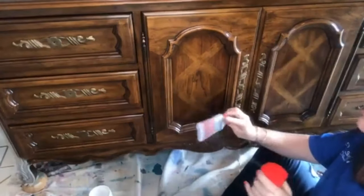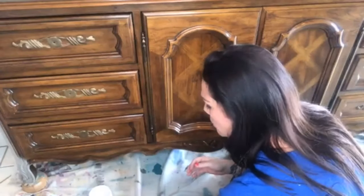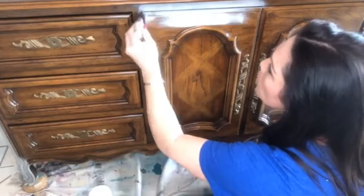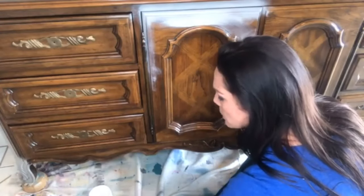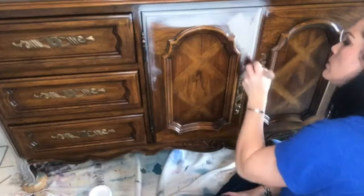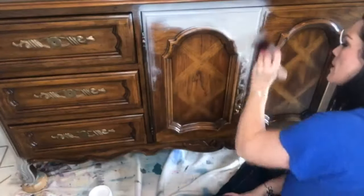Before I start painting, I always lightly mist my brush — not soaking wet, just a little bit damp. This is French Linen. I cleaned the piece really well with White Lightening, then rinsed with vinegar water. When I clean my pieces, I use a finishing pad to scrub them real well. I took a little video when I was cleaning it to do a TikTok on how I clean furniture. That's how it's been prepped.